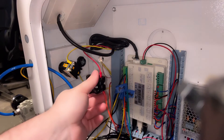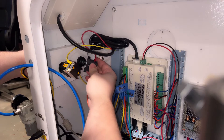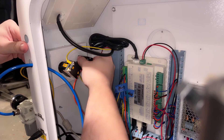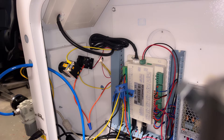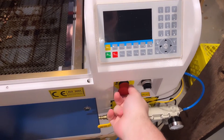These connectors are directional generally — they won't just pop right on, they have to be oriented just right. There are two flat edges, so I'm going to look for those and get them properly aligned. With that now popped on, we are good to go — it is retained perfectly. The machine is off and unplugged, so we're going to make sure the e-stop is engaged before plugging in. We walk around to the front — it's still off until we twist and pull out the e-stop to open it, and it's going to home. We are back up and running with the gantry. All we needed was an emergency stop replacement and to get rid of that broken switch.